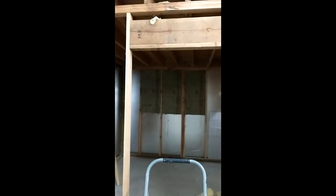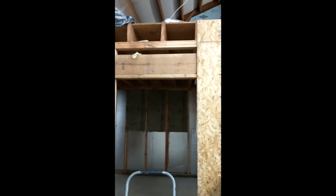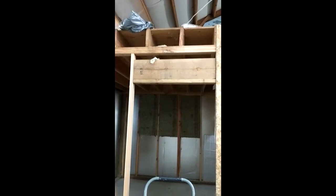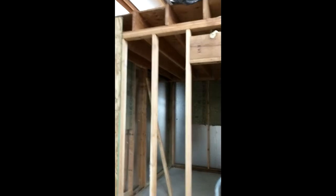Nice solid header they put above this 36-inch door. I'm switching it to a 32-inch door and actually going to move it over so it doesn't take up the middle of the room. They put a solid header in — real smart. But a solid header is useless if you don't put the cripples in to touch the top. So I'm going to move it over and I can reuse that stuff — just cut it back into the dimensions I need. I've got to put some cripples in to support this ceiling temporarily, and then I also get to cut out the lag bolt that they put in there.